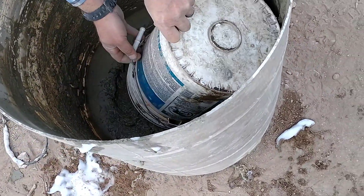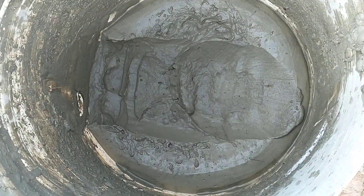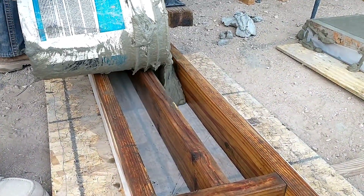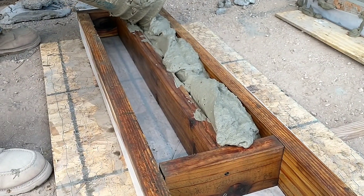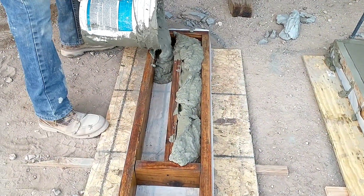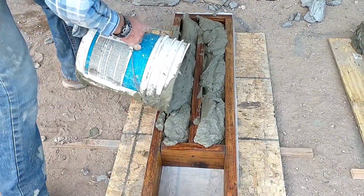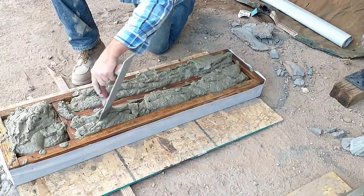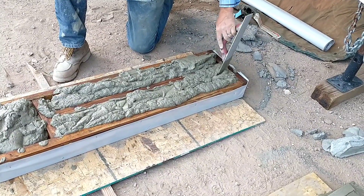This is batch number 12, which we're using for the chicken wire. We used the same recipe and tried to use all the same techniques as the last batch. I put the first bucket in the garden wall and then started pouring it into the forms — it looks just about identical to the last batch, which is good because we wanted them to be as identical as possible. The actual chicken wire we'd use in our house would be a heavier gauge galvanized chicken wire sold for stucco — a good product already pre-made and ready to go inside concrete.